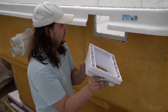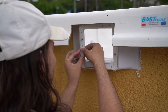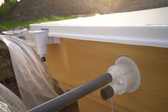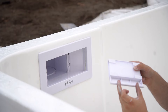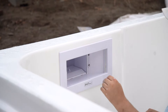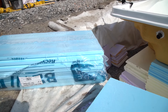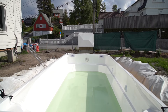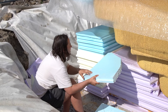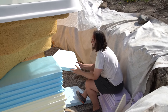Normally one skimmer is enough, but we custom ordered two skimmers for two reasons: it will look more aesthetically pleasing to have one on each side of the counter current, the flow will be more consistent, and you have the possibility to upgrade to a more powerful pump in the future. We decided to support the stairs, the sitting areas, and everything else without concrete support using XPS plates. Usually you'd build a column of brick as support, but since we had leftovers that could be cut exactly to the pool's measurements, we went with our creativity and used the plates instead.